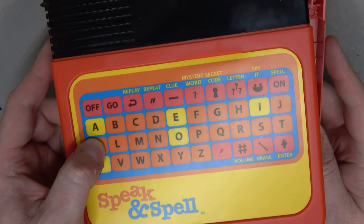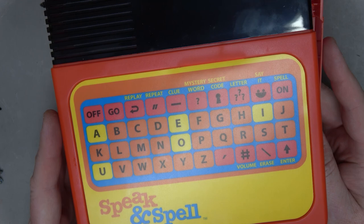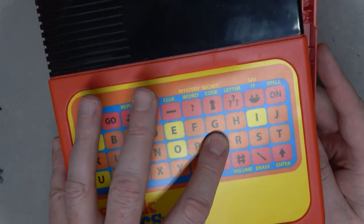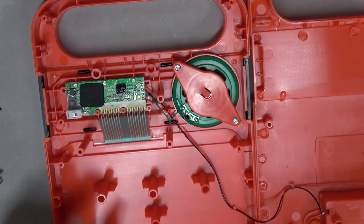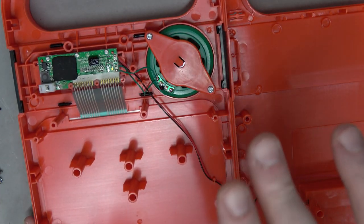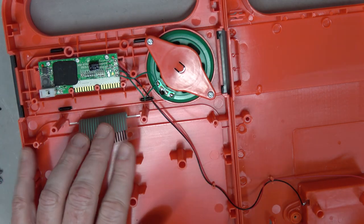This is just the holddown for the matrix. Unlike the other one we looked at, this is just going to be column-row matrix with silkscreen conductive ink printing. See the carbon contacts right there? This is probably just a sticker with two layers of conductive ink plastic, and when you push the button it makes contact — the same way most modern keyboards work. Although there's no tactile feel whatsoever. Who cares if it's tactile? It's for kids. It's cheap.